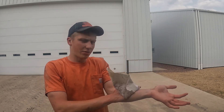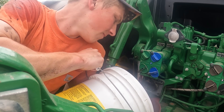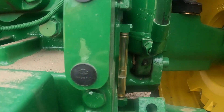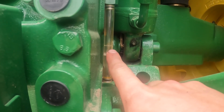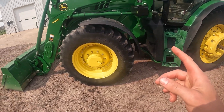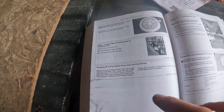I figured I'd wipe off one last time and try to get as much oil off me as possible so when I enter the cab it doesn't get all over. Just try to get that off before we fill it up with some new hydraulic oil. I've got to keep putting hydraulic oil in until the oil level gets between the minimum — this white mark on the gauge — and the top. I got the hydraulic oil changed. It took about 17 gallons, so we should be set for the 1500-hour service interval.